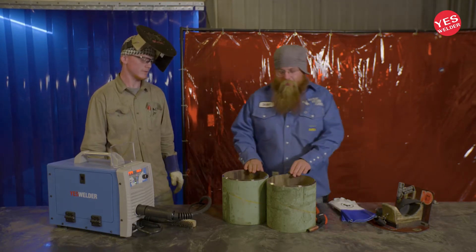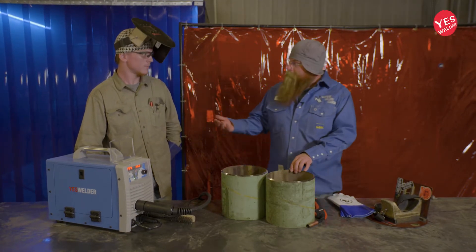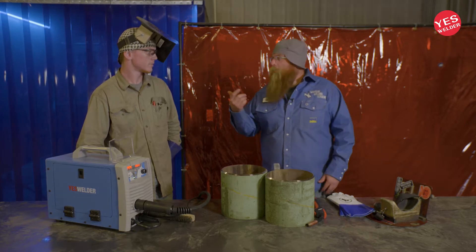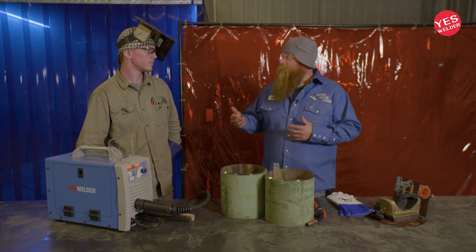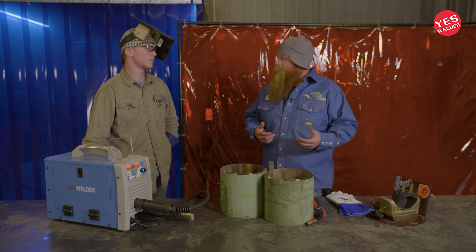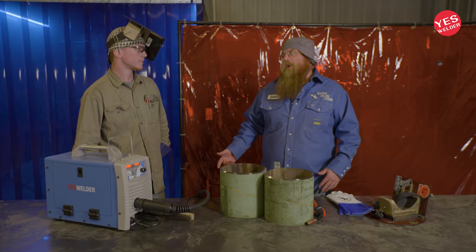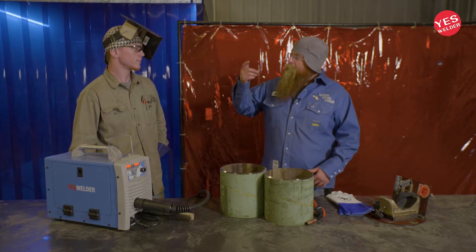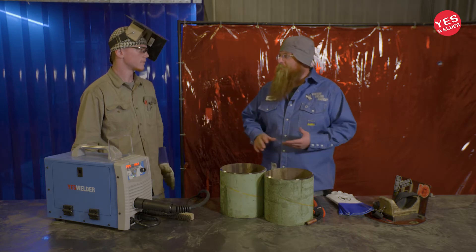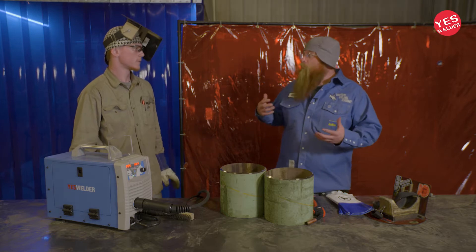So today we're going to do a little MIG root. We're going to be doing a MIG process in general — throw a MIG root through here. We're going to stay right on the edge of that puddle, 035 wire, running just 75/25 gas, pretty standard. What you're actually going to see out there in a fab shop — they're going to be running these roots on the lower end. You don't have specialty wire or specialty processes. You're just going to run a short circuit root, and then throw an uphill fill with hard wire. It's a little crude, but it always gets the job done, and it's actually a really strong process.